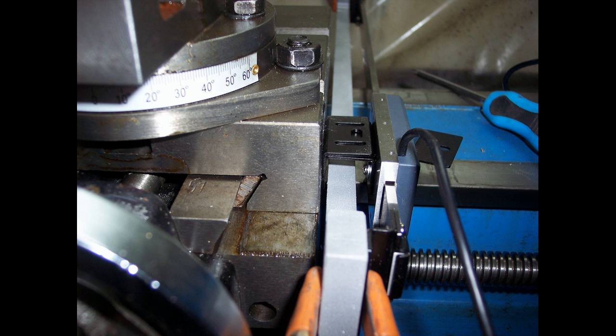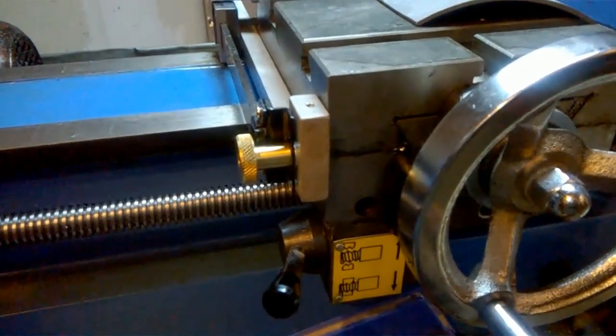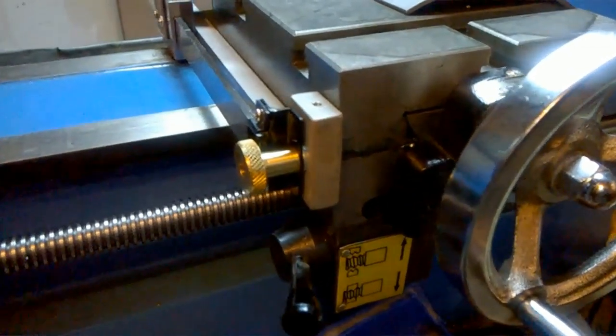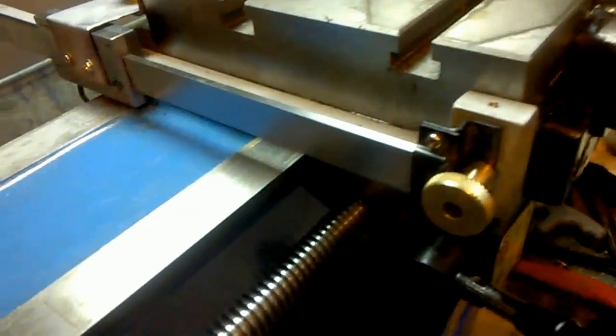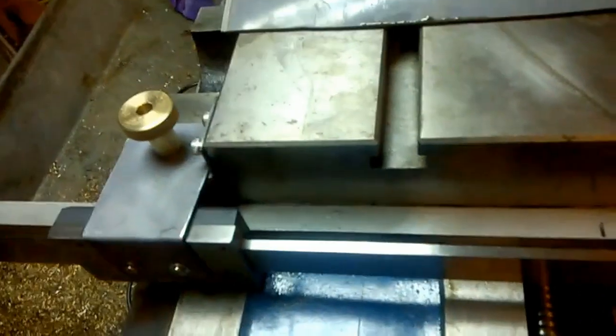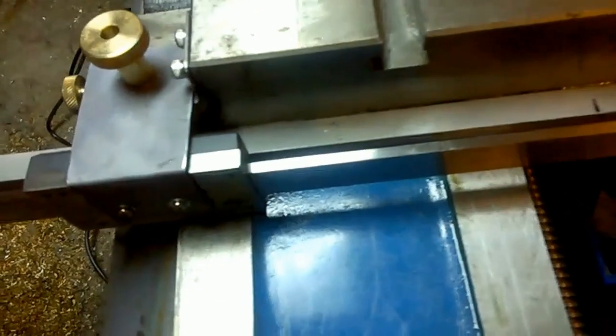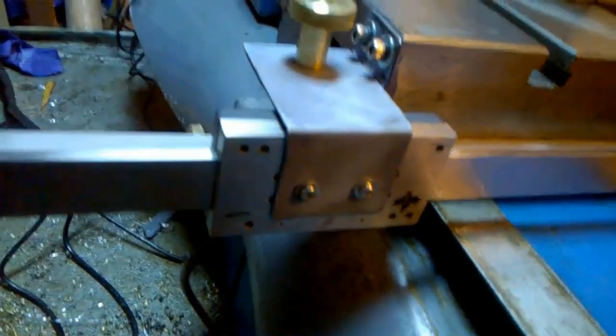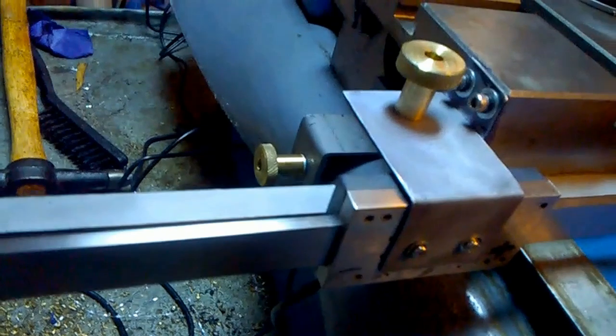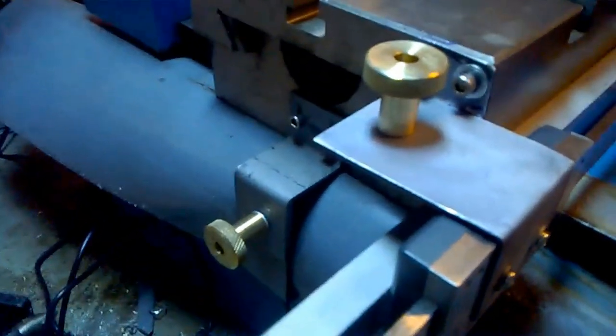So I had to change my thinking and I moved the entire assembly for the cross slide to the left side of the carriage. Here it is mounted on the left side, and you can see the brass thumbscrews that I made for mounting the DRO bracket to the mounting bar. Mounting it in such a way that I can move the DRO scales from one machine to another relatively easily is why I have these thumbscrews holding the brackets to the machine.